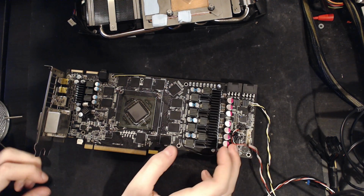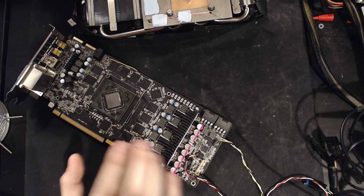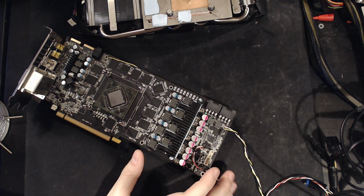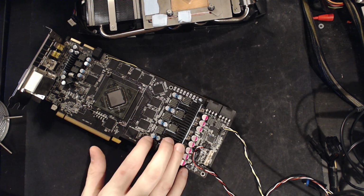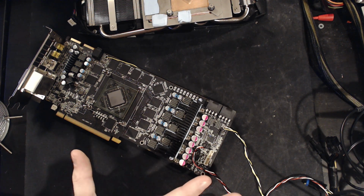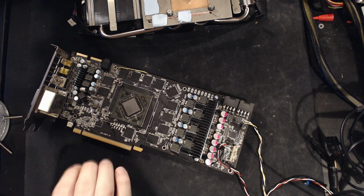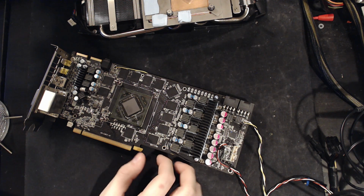You're stupid. Cool. Anyway, that's a CHiL CHL8228G voltage controller. It's really common for HD 7970s. All the other cards using this, except the Vapor X line, have voltage control. Not the Vapor X line. There's something weird that Sapphire did to their BIOS that locks these cards out of voltage control. Don't know what it is, but it's an issue.